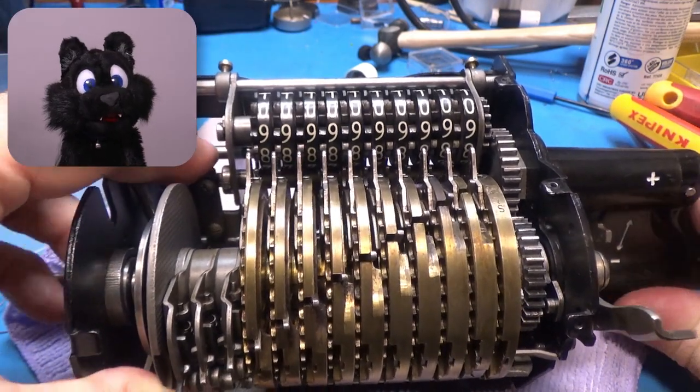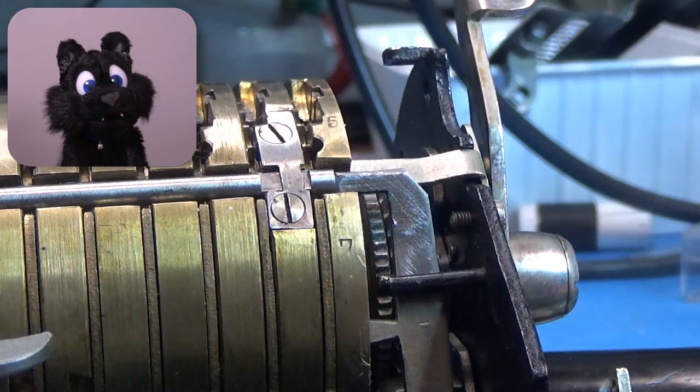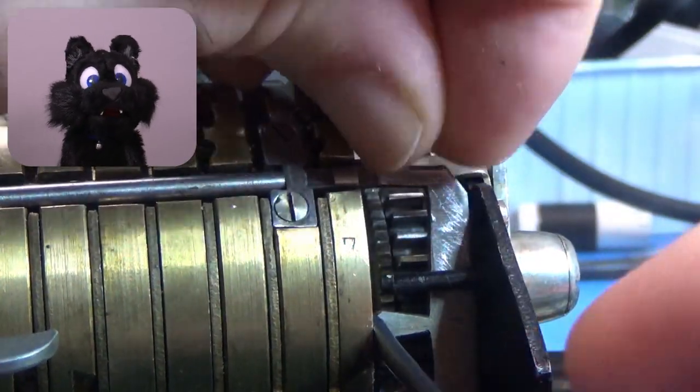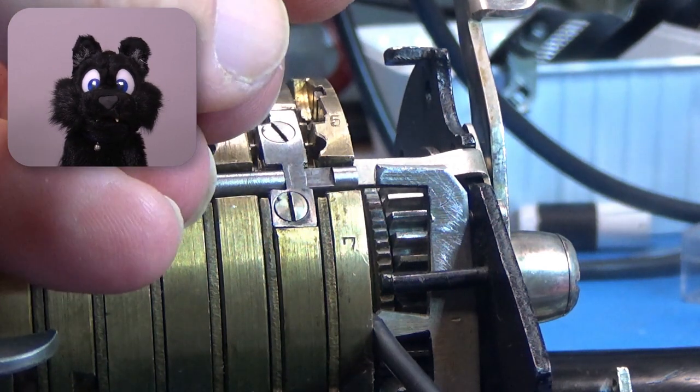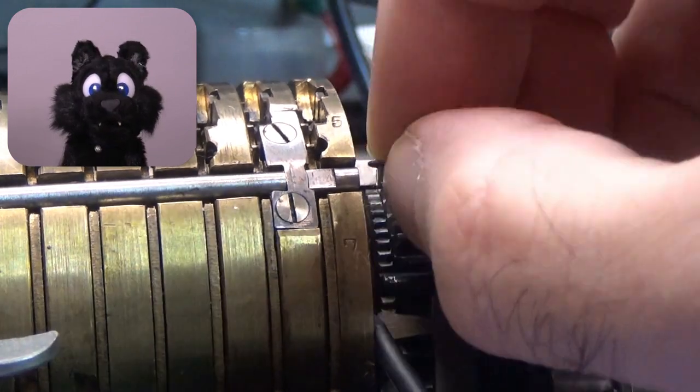The next step is a bit more critical. The main drum needs to align with all the interlocks, and there's only about 1/10 of a millimeter tolerance on those, if at all. That took some tweaking in the linkage.